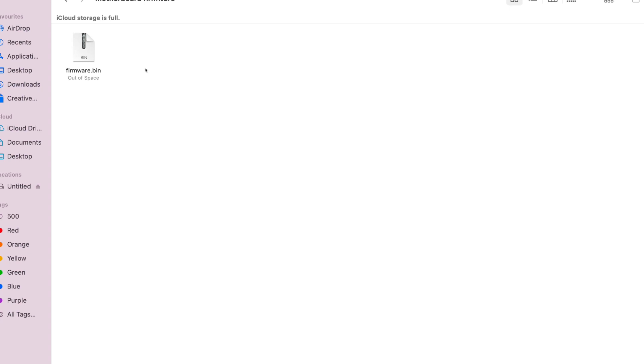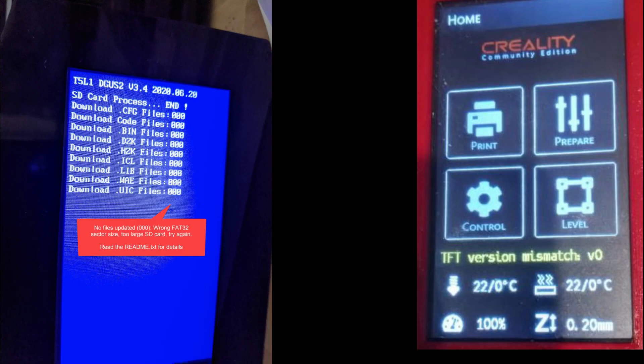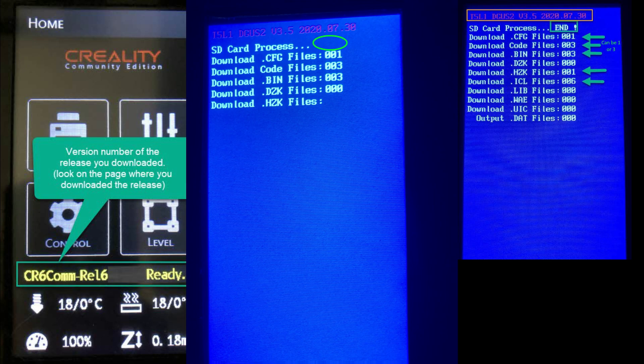I would suggest you don't use anything more than around an 8 gigabyte SD card. The touchscreen firmware — which is zipped — will give you a small headache if you don't get the file size correct. As already stated, read the readme.txt — depending on whether you're on Mac, Windows, or Linux, it should give you that information. All you need to do is take the dwin.set file and put that onto the SD card. The good news is it will also show you on screen whether it's flashed correctly or failed. If you've not managed to format the SD card correctly for the screen, these are the kind of problems you're going to have — so what you want to see for a successful flash is this.